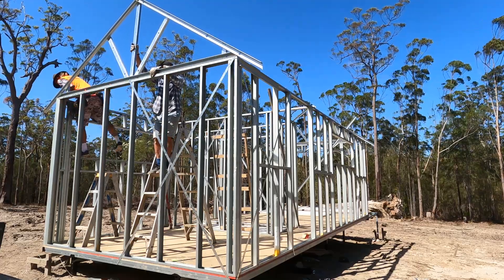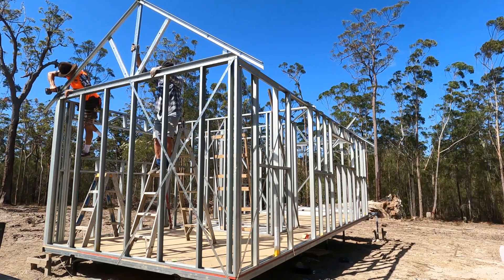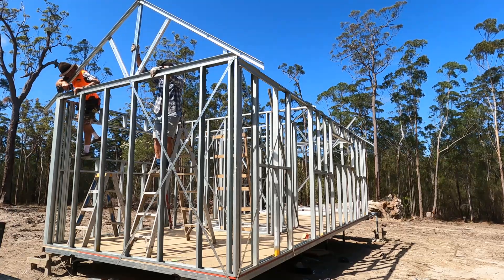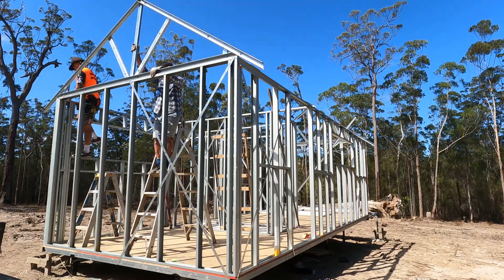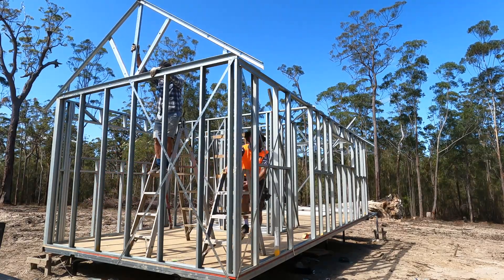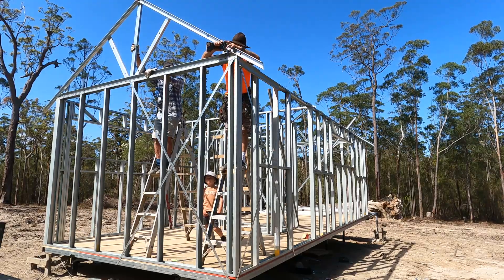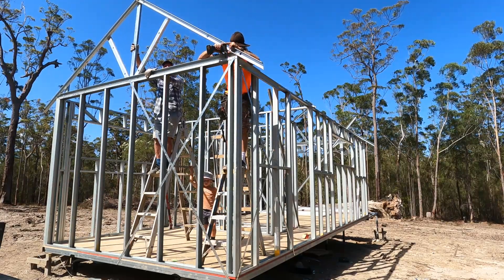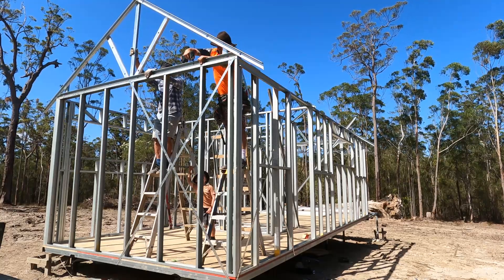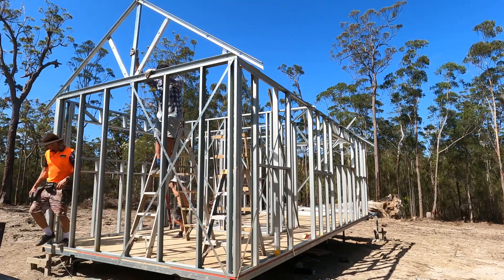Here is the first truss going up. It rolled up nice and easily — they're nice and light, light gauge steel framing, so they're easy to handle. I'm screwing down this first corner. To make sure it's in the right location, I've lined up the bottom cord of the truss with the external part of the outside wall. I know my walls are straight because I've plumbed and straightened them all, so as long as you're lining up every truss at the same point on the outside of the wall, every truss should be in line.